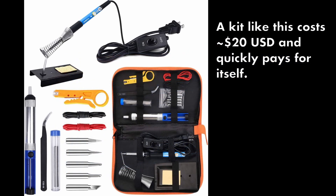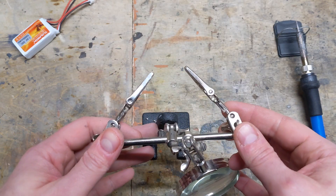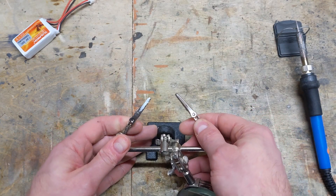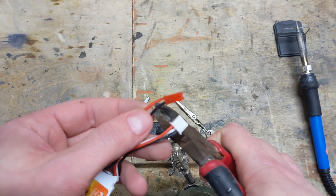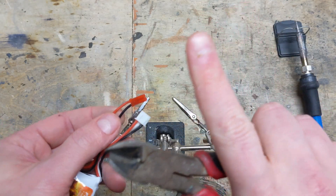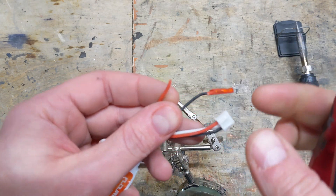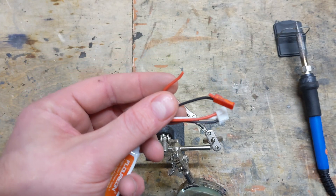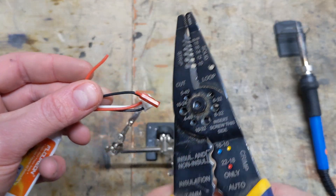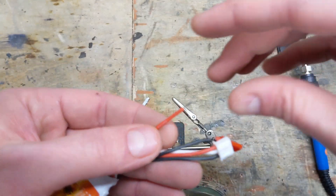If you've never soldered before, this is a perfect opportunity to learn. I start by plugging in a soldering iron to heat up and position a set of helping hands with alligator clips on my work surface. Now I use a pair of wire cutters to snip just one of the wires. Only cut one of the wires at a time — never both at the same time — because the metal of the cutters will complete the circuit and you might have a bad day. Plus, it's best to only have one wire exposed at a time so there's no risk of accidentally shorting the wires. So now that I've snipped one wire, I use a wire stripper to pull the wire sheath from the end, exposing the copper wire within.